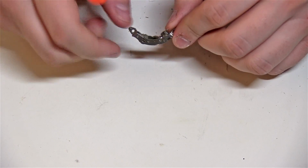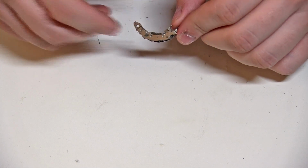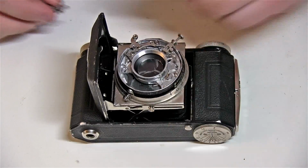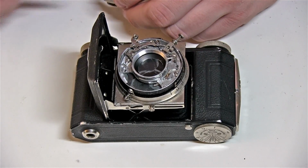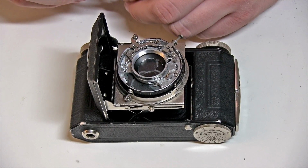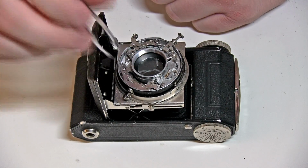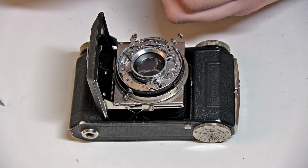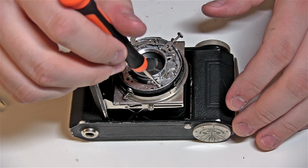I tend to reset my spring for my camera to work after having the gear lever unstuck, which was really stuck. So once you have fine-tuned your spring, you can reattach it to the camera and have a test run to see if it works. I had to take out my retard gear housing 6 or 7 times before it worked as it should. Basically just drop it in.